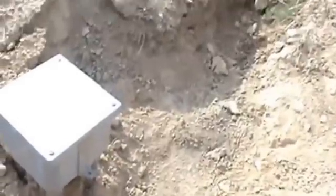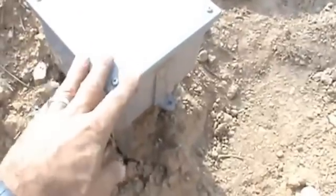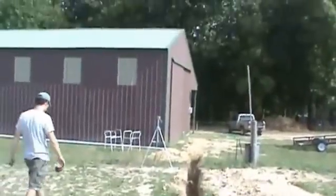There's a simple pulley welded to the base right there. The base is quarter inch. All the wind turbine wire runs underground and goes into this plastic weather-type box. All the connections are in here — it just runs underground, in a trench all the way up to the building.